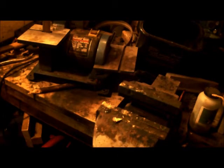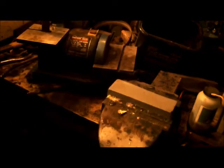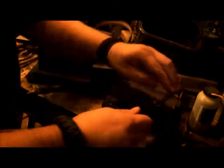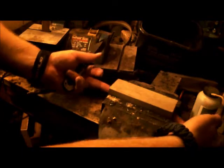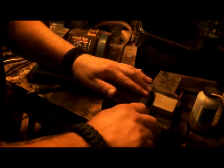Place the tripod. Boom. That's the blade. That was a forge. Now I've just found the bevel. I've lifted it up and it's just sat on the bevel. That's quite coarse. Put it on the fine side. I can flip it over because the water's gone from the top to the bottom. Now I've turned it over and the water's now in this half of the stone.